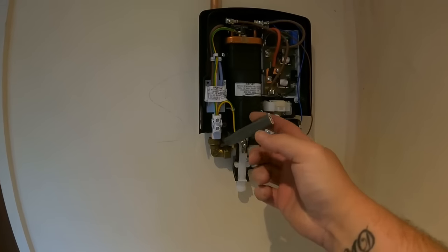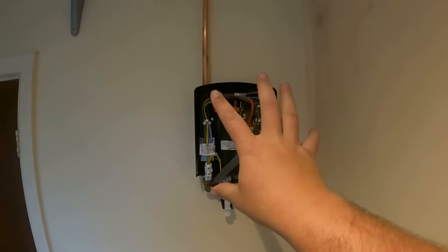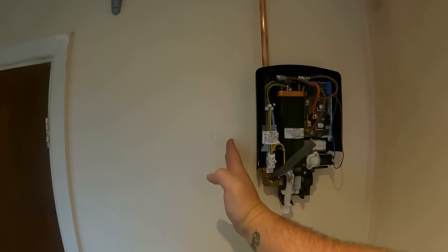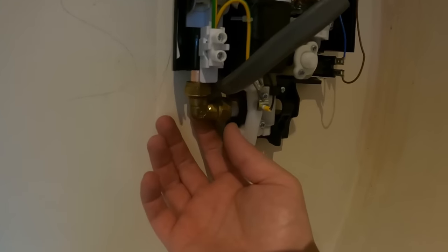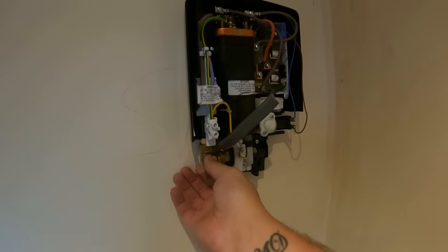The shower is positioned where the cable came through — the electrician drilled that through and we can connect in there. These showers come with a riser rail and a rainfall head coming off the top, so we need to keep it quite close to where it comes up. I've got the compression elbow on. I'm going to use press fit for this pipework — it's a lot easier up here and also the alarm is connected to the building so press fit avoids any soldering risk. We'll put it on, run it around, and drop it down.